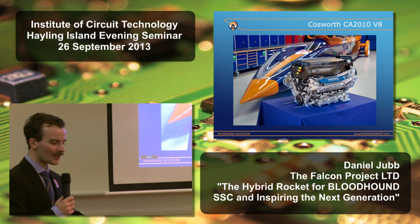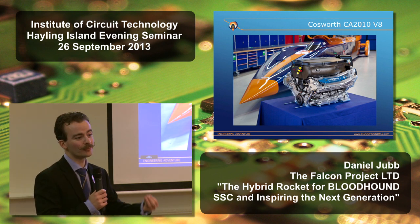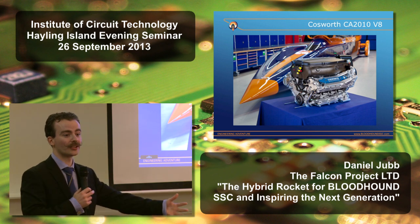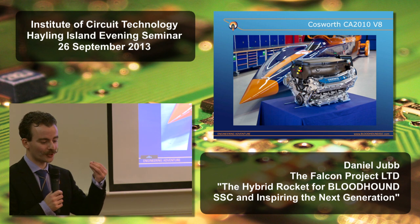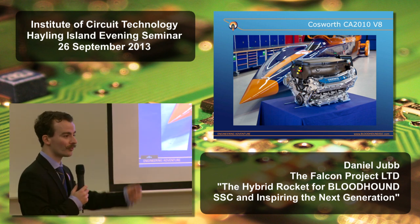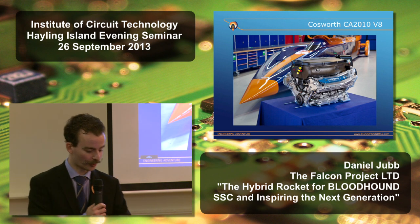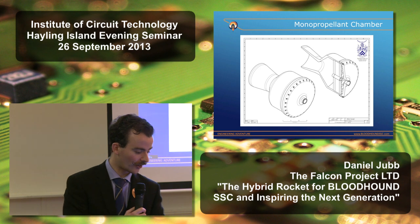For Bloodhound, the problem with those turbines is that if you get the flow of HTP to the decomposers wrong, it can pick up speed at about 50,000 RPM per second. And if the turbine discs fail, you have enough energy there to cut the car in half like a buzzsaw. Again, we're not operating outside the atmosphere. We've chosen a more earthbound power plant in the form of the Cosworth Formula One engine. It's a 2.4 litre V8, spins at about 18,000 RPM. So we need a reduction box to drive the pump. Cosworth have been a big supporter of the program. And that engine, which weighs less than 100 kilos, gives us our 800 horsepower.